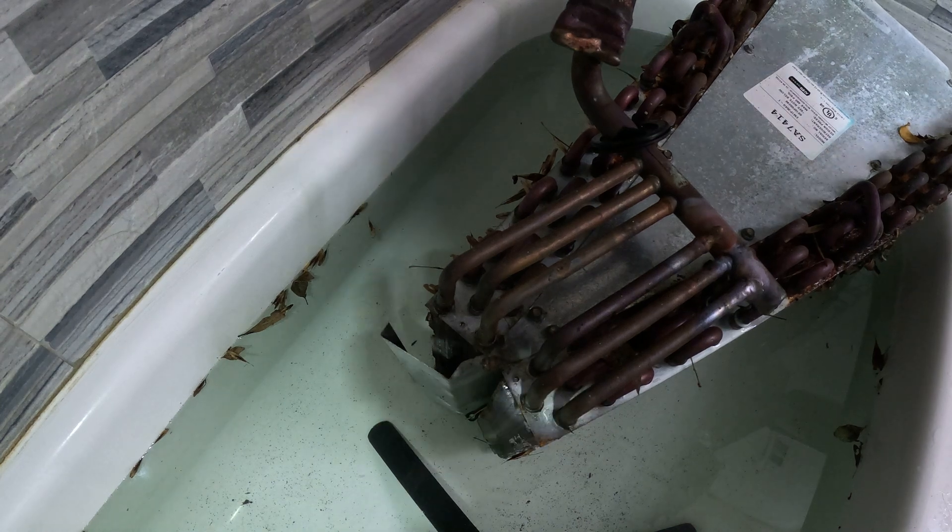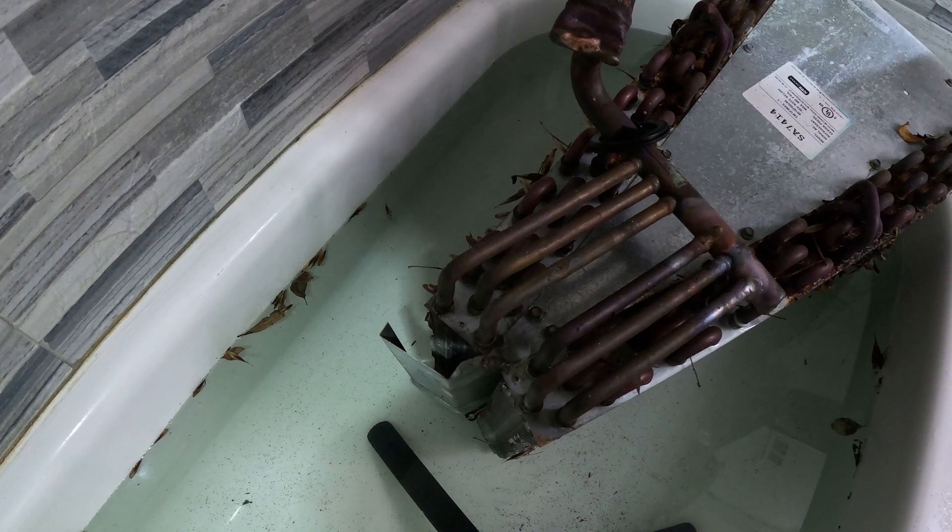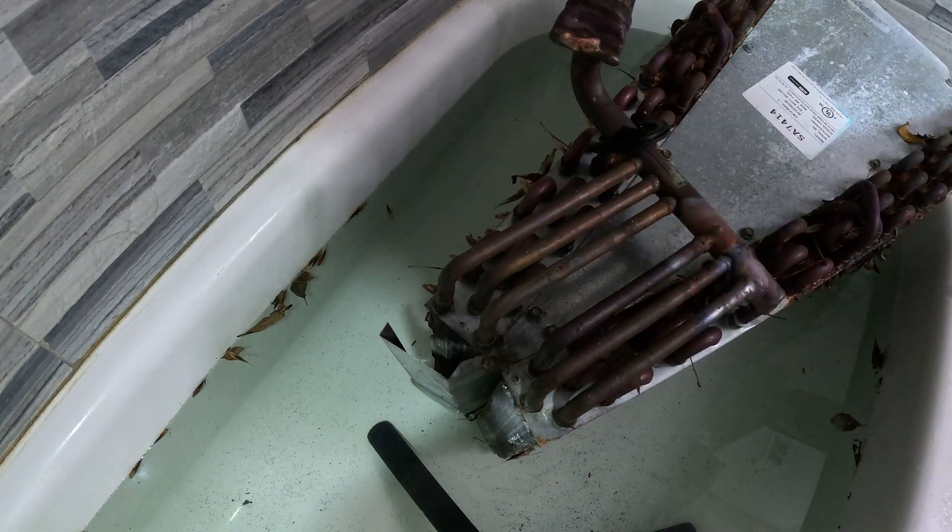The leak was right here — that's how you fix the leak in your evaporator coil. Slide the coil out of your unit, submerge it underwater, put about 50 pounds PSIG of pressure in the coil, and the bubbles will show you if you have a leaking coil. Thank you for watching.